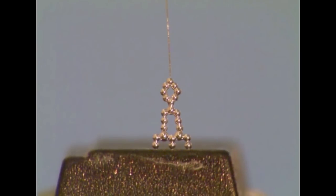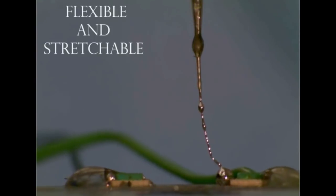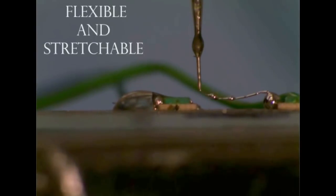In addition to stacking droplets, it's also possible to make wires. Here we just apply a burst of pressure, the metal shoots out, and it oxidizes so fast that it becomes stable. The resulting structures are deformable and stretchable because it's a liquid, so we can make stretchable connections. And then finally, the student who worked on this found a dead bug — and I promise you it was dead — but just for fun, gave this little guy some extra appendages. These don't actually have any function in this particular example, but they show just how small these structures can be and how gentle this process can be. It's literally a room temperature process.